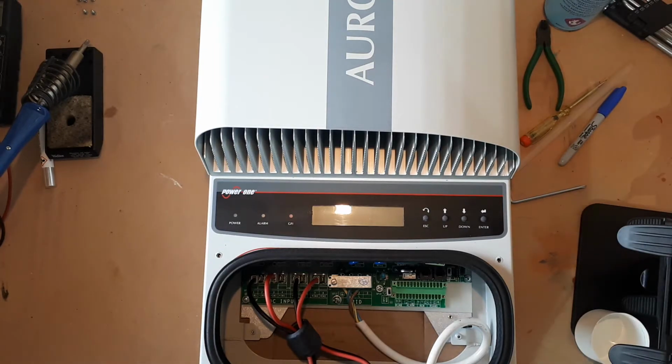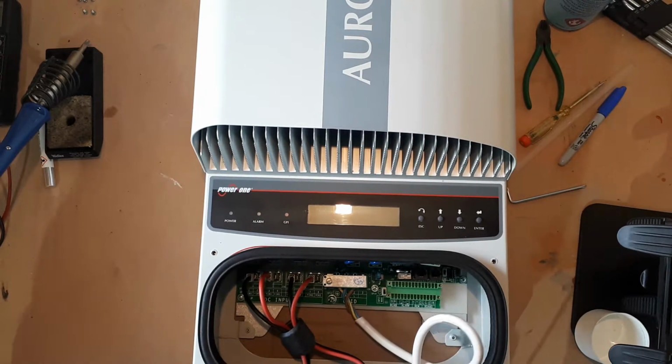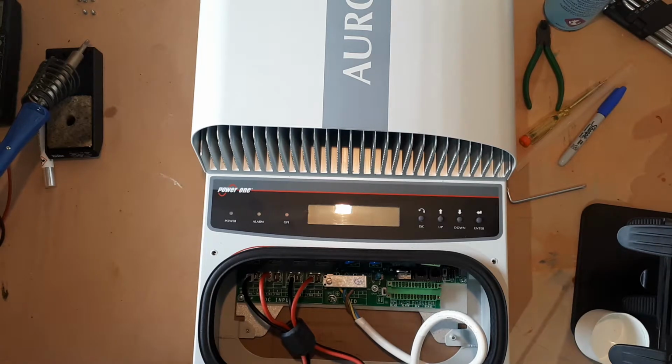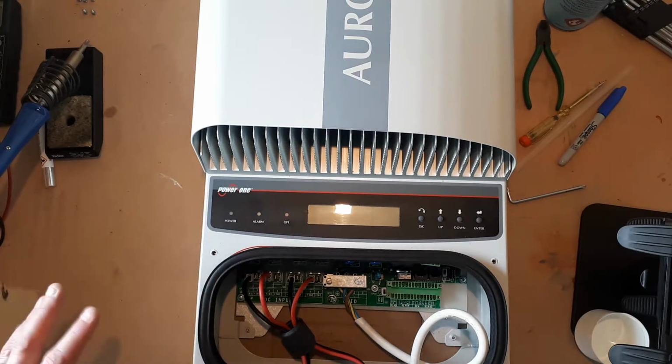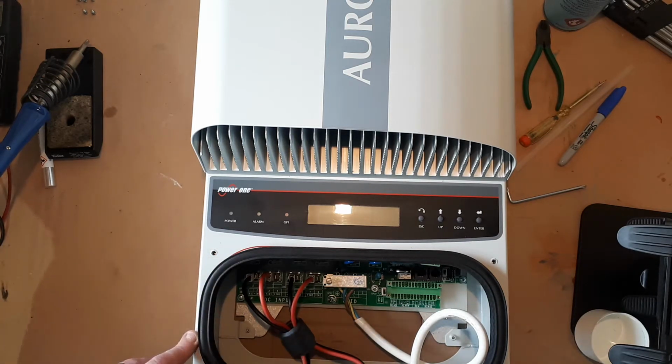So first things first is you need to take the inverter out of the location it's in, and if you feel in any way uncomfortable like that, then this isn't a job for you. It's really heavy, you've got mains power that you need to be disconnecting carefully, and most importantly, when you come to disconnect the DC, this can be under no load whatsoever, and it's actually potentially dangerous to disconnect these because there could be quite high voltage on them. So we're starting off by saying, if you're uncomfortable with any of this type of electrical work, let's just stop now. We are comfortable with this type of work and we want to get this fixed because we're only 6 years into a system that was really designed to last about 20.